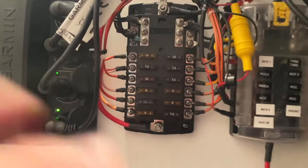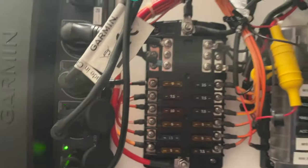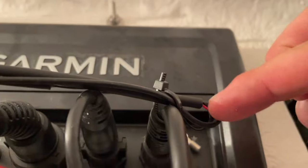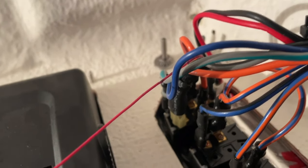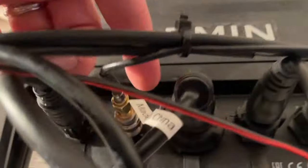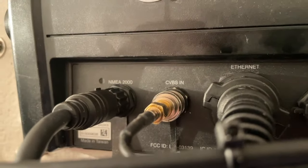Inside the console we're essentially done. We took the black wire, our negative lead, and took it to the negative bus bar — we tied it into the navigation lights, ran that wire up and tucked it all in with zip ties. Then it joins the factory cable we ran down. We've got the positive lead tied onto our navigational lights, which are on a jumper to the anchor light — so when anchor light or nav lights are on, it'll turn the camera on. The camera is wired into the back of the Garmin on a CVBS-style connector, which the Night Wave comes with the adapter for.